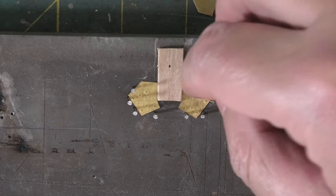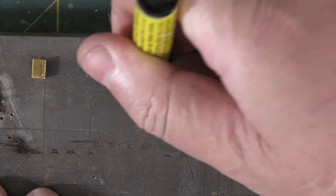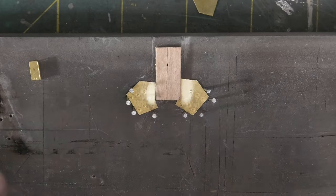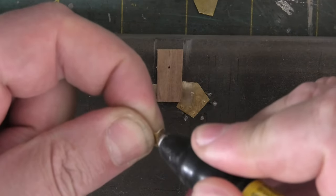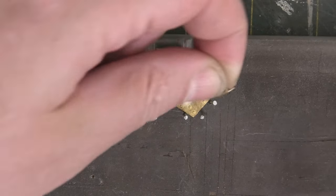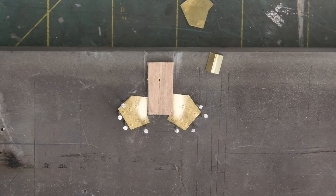I'm going to remove that for starters, get my fiberglass pen, and just clean where I want to solder the brackets on - that'll be nice. Then I'm going to heat up my soldering iron. I'll get my angle bracket and again clean the side that I'm going to solder in place, so it's nice and clean. Somewhere here is my flux - I'm not going to need much at all, just the tiniest little spot.